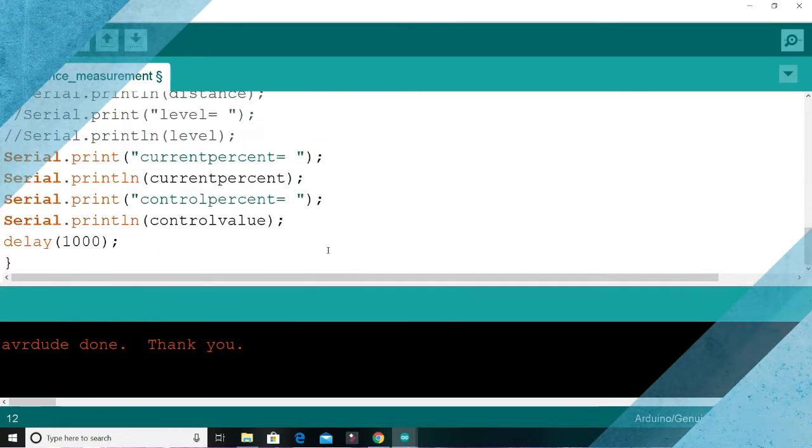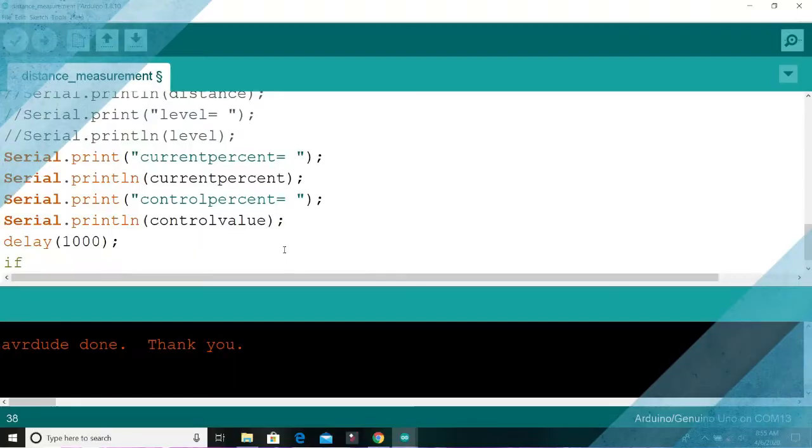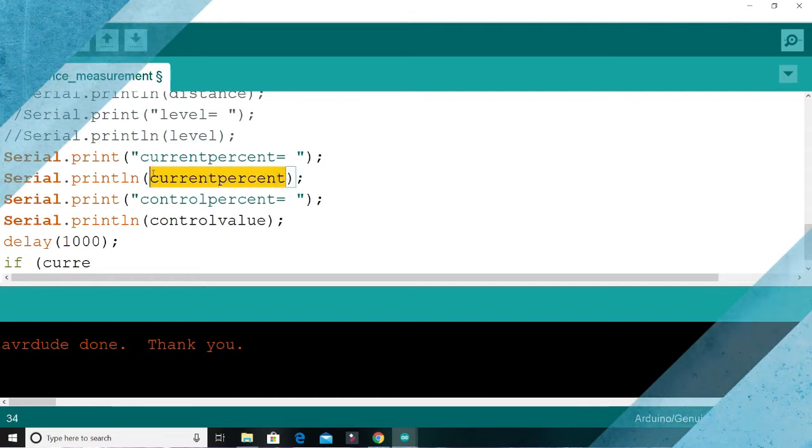Now at this junction we need to write a conditional statement: if the water level is down and is below, if the current water level now is below the set point, then the pump should come up. So we say if the current percent, let me copy this, if the current percent is less than or equal to control value,